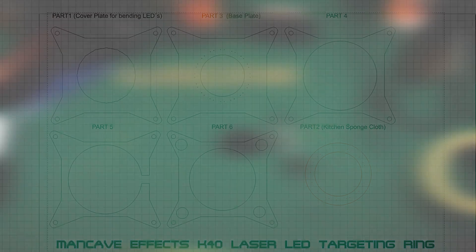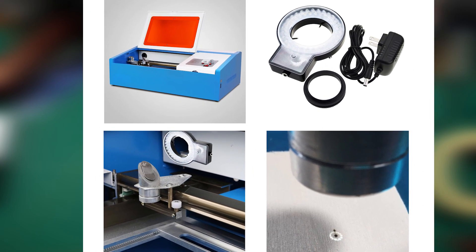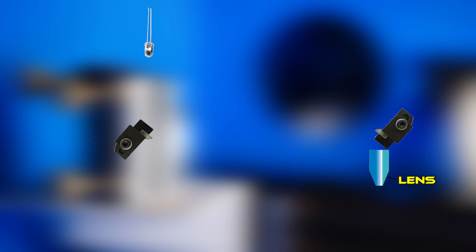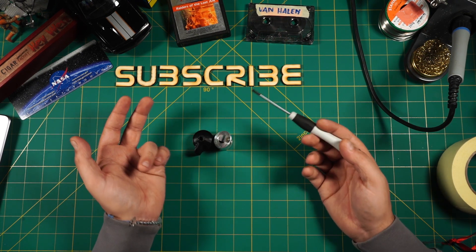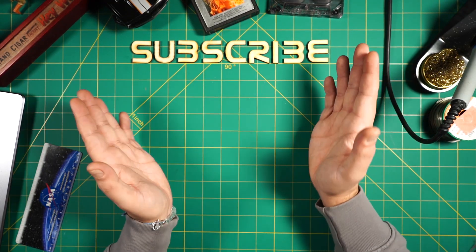That Chinese email from Tao Zhong states having a LED ring that mounts onto the back of the laser head right after the first mirror — no drilling, no adjusting, etc. Too good to be true, right? Already at the first thought I was pretty skeptical, because sending unfocused light over two tiny 20mm mirrors doesn't sound like something that will give you much of a visible output, even when considering the light gets focused over the laser lens. But I thought I'll give it a try and build something of my own to see how much of a reflection stays visible. Now let's get started building the LED focus ring light.